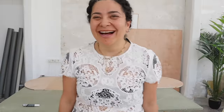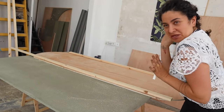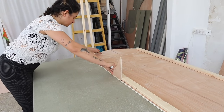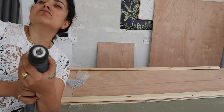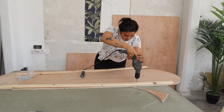Reality check: we are going to have to add some very long wood lines that are going to hold the weight of your body if you want to throw yourself on the couch. We're literally going to use the depth of our wood as a guideline — place it perfectly straight, mark it down and cut out the extra. Now do it four times. To be 100% sure that nothing is going to move, we're going to put a lot of screws to place down this 2x2 beam — however you want to call it. I'm going to make about five holes for every side.